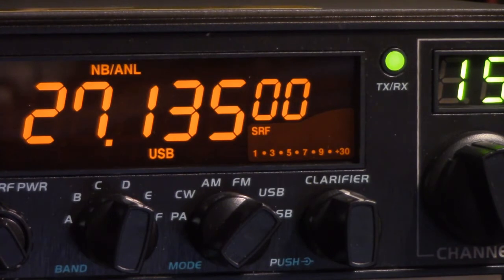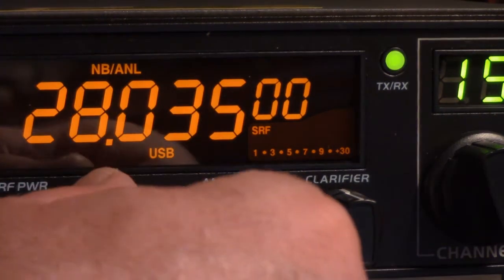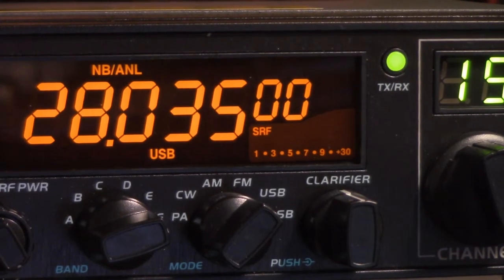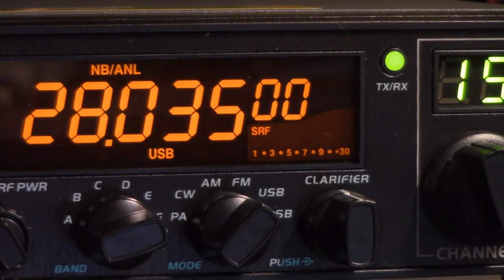So that'll be a good thing. The way I intend to set it up is I plan to set bank F as the FM sub-band basically — or at least have the upper couple of channels be 10-meter frequencies. Because AM activity on 10 meters is pretty channelized, and FM activity on the top end of 10 meters, 29.6 to 29.7, is absolutely channelized. So I want to set it up for all of the 10-meter FM channels, including repeater splits — and this radio will do repeater splits, by the way.